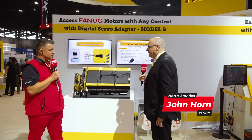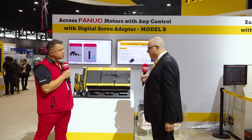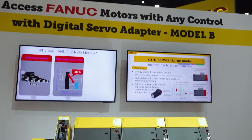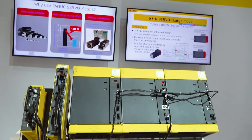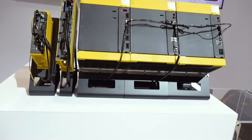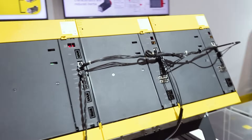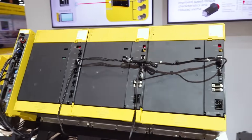It is special because this isn't your standard FANUC CNC, motion, or robotic system. What we've got here is our IPC on the far left — an industrial PC. We're running an EtherCAT system with a PLC, sending commands to the FANUC digital servo adapter, which adapts those EtherCAT commands to FANUC servo drives, which are then running the motors.